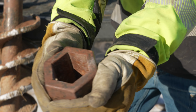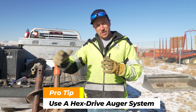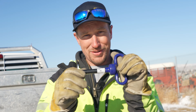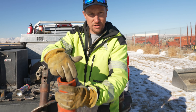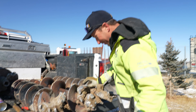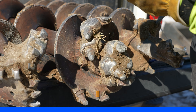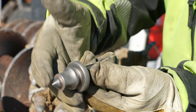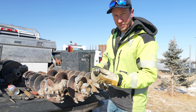One thing to note — we're using the hex drive. The reason we use the hex drive is because with the round drive, when it turns, you're putting all your force and torque on the pin, and that's simply what is holding all that torque in. Whereas if you go with a hex drive, it locks into your auger drive, and the only thing you're using the pin for is to hold your auger to your auger drive. We're on the rock auger now, which has bolt teeth in it. Its intended purpose is that when it lands on a rock, that tooth sits there and spins inside the collar, chewing on that rock until it either grabs the rock and spits it out or passes through it.